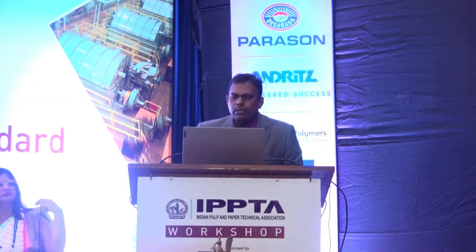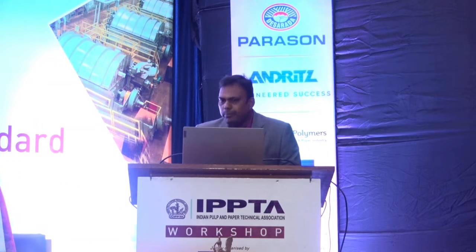If we talk about non-wood fiber like bagasse or wheat straw, we have to use a horizontal digester, and it has a very low cooking time. It's around 22 to 25 minutes retention time. And this non-wood fiber has very poor drainage properties compared to hardwood. Because of this, we have to use very big equipment, because the loading factor for bagasse is around 2.5 tons per square meter, whereas for hardwood pulp it is around 7 to 8 tons per square meter. That's why you need very big washing equipment.